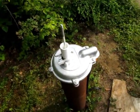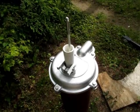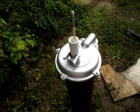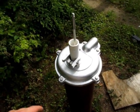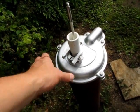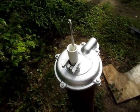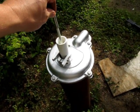Well, yeah, that was a little nerve-wracking because as soon as that pump cleared, it really wanted to drop, and it was kind of slippery, and I was worried that when I finally got it down to the safety tool that maybe the safety tool wasn't the right dimension or something was going to go wrong. But as you can see, it's standing there. Sucker rod standing proud here.